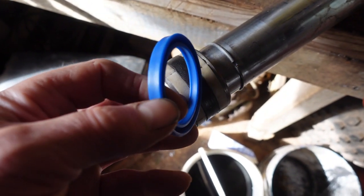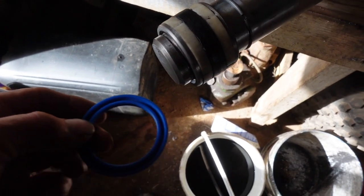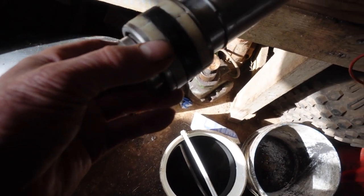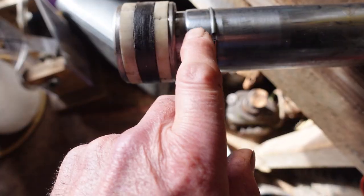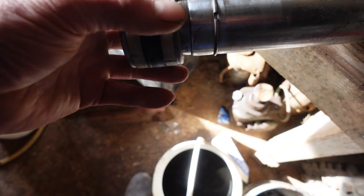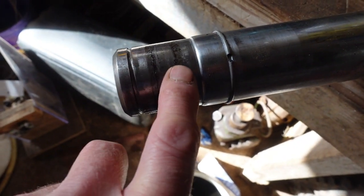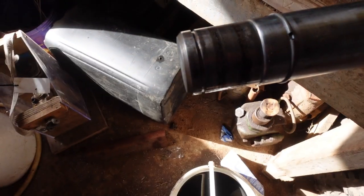The seal has finally turned up, ten days later. What we have to replicate is an inch and seven-eighths diameter blended onto that two-inch diameter, polished to work that seal in both directions - just like that, with the snap ring groove.